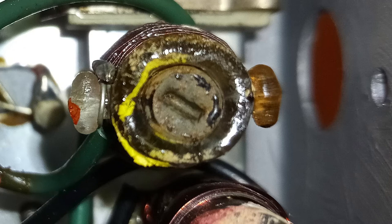But the same technique cannot be applied to the oscillator and antenna coils, because the plastic would melt, as the picture shows. This makes it impossible to align properly the dial scale and the tracking between oscillator and antenna section. Anyhow, the radio can now work sufficiently well.